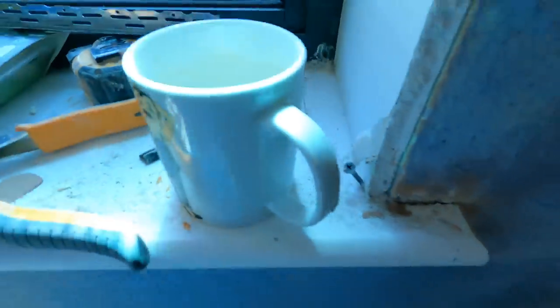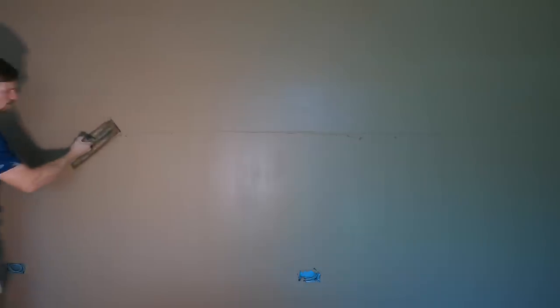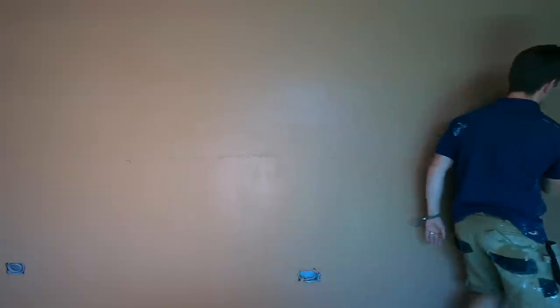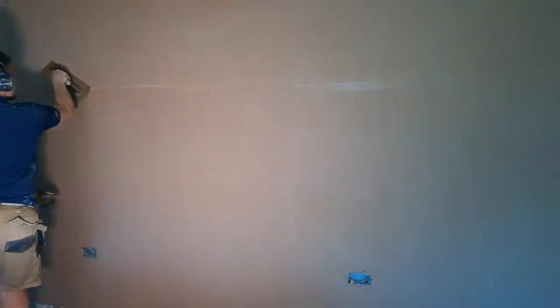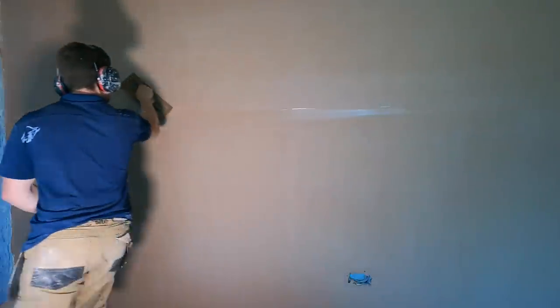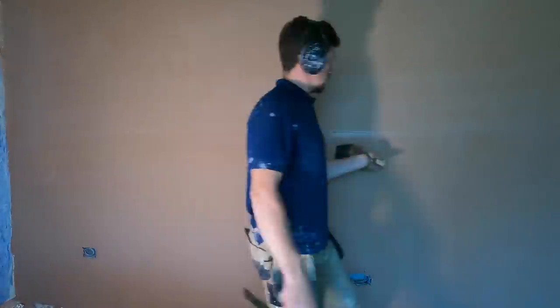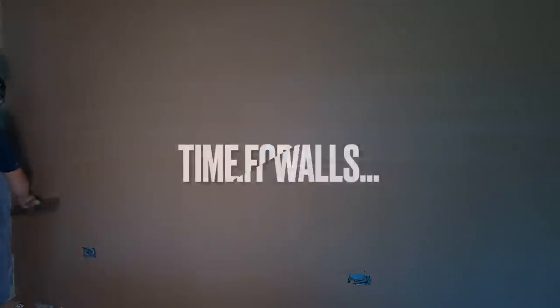I casually dunked a croissant — croissant and cup of tea, can't beat it. So I've applied a second coat, flattened it with a trowel, now I'm cross-troweling to get the flat walls in. Finishing with a wet trowel, then a dry trowel after that. The plasterboard went off relatively fast, but now it's time to plaster the walls with the blue grit.